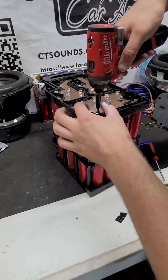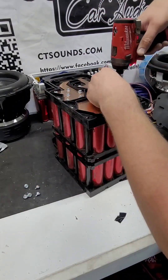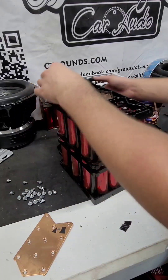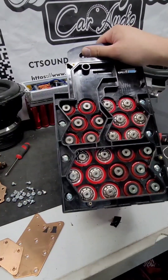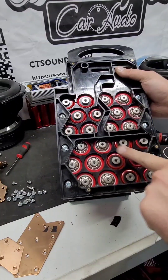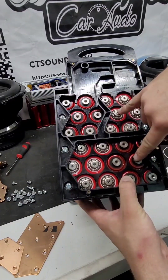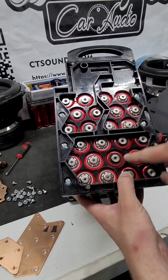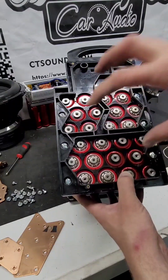To do that we're going to have to pop off all the end caps — every one of these has to come off. Once you get all these out you can just remove them like that. Now you can see the inside of the cell pack. Basically the red are positive and the black are negative, going positive, negative, positive, negative — we want to reverse these. Right now there's 12 volts here and 12 volts here, it's just backwards. If you wanted to run a little jumper from here to here like most people do, that's fine — but you're limited by the current going through that little jumper, and I think I can make this look a whole lot better.